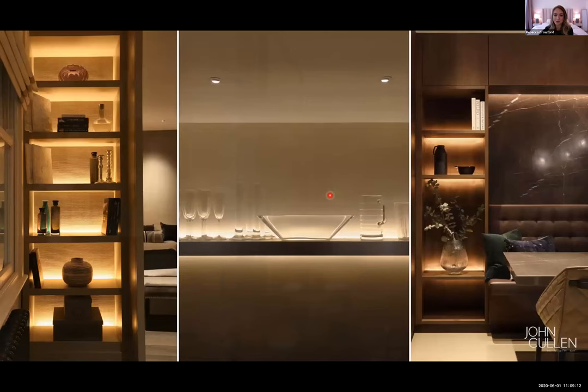Where the light hits the object is going to completely change the shadow play, and the beam intensity will change things further. Moving on to perhaps one of my favourite forms of joinery lighting: backlighting with linear strips. It's very simple when you know the methods and how to integrate it. It takes a little bit more forward planning than our previous method, partly down to the placement of the strip, and requires more thinking about materials and what's contributing to the makeup of the joinery.